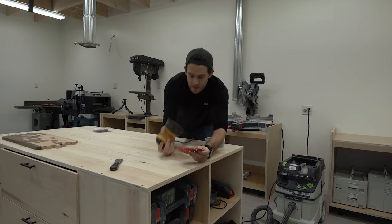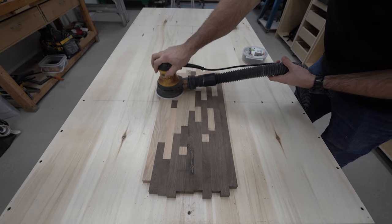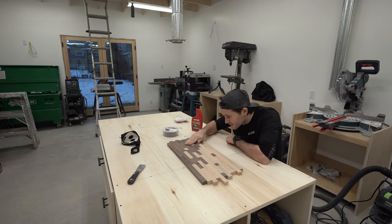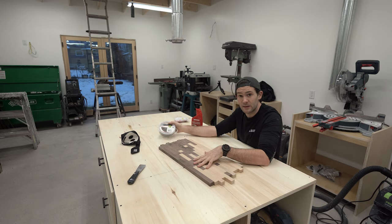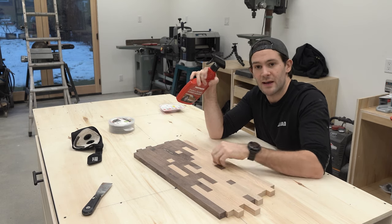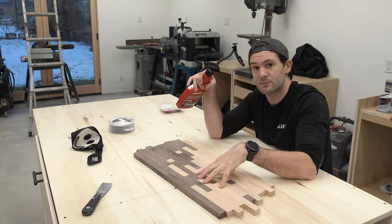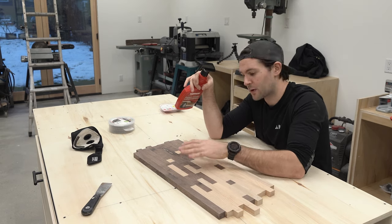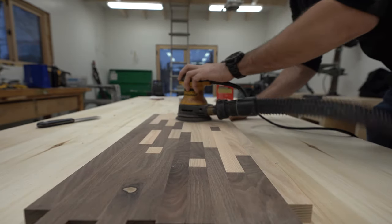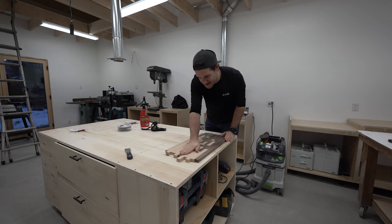It's not perfect, so we'll do a little more sanding. I'm going to start with 80-grit sandpaper, and then once it's nice and smooth I'm going to move up to 220 grit to get a really nice smooth feel. Before I move on to 220 grit, I'm going to teach you guys a little trick. I emptied out this bottle and filled it up with some warm water. I'm going to spray down the surface of this board, which is going to raise the grain of all this wood, and then I'll give it another sand to knock down all of that swelled grain. That way it'll be really smooth, and more importantly, if you ever put something wet on this you won't end up with a part where the grain swells up — it's part durability and part finish. I could do this all day. It's like glass, this thing.